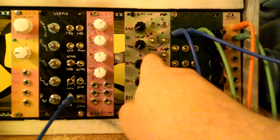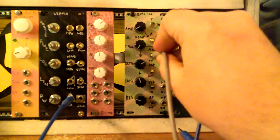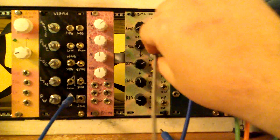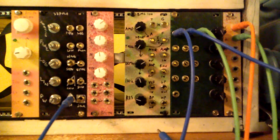Next we have our noise output here, so you can just listen to that. This is an improved noise circuit that should be more resilient in case you got a bad-sounding diode that wasn't as noisy. It's also pretty good at rejecting noise from the power supply, which the original DAN wasn't as good about.